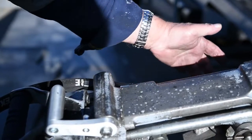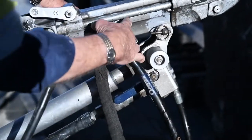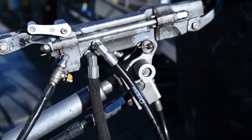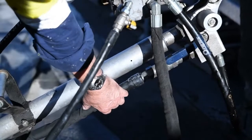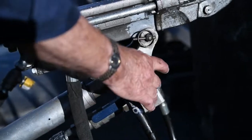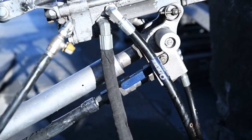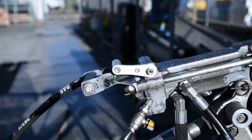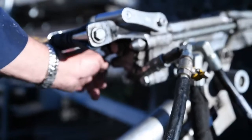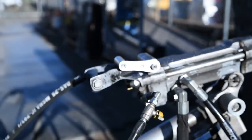Your inlet line tees on the valve of the leg, comes round and goes into the inlet side — it's got it written on the drill: 'in'. Then your outlet is the drill back to tank. You've got your third one which is the leg return to tank. And this is water for flushing. The knob at the front is the throttle for the leg, the blue handle is the dump for the leg, and this is the drill throttle. There's a little lever here — that's the rotation: forward, reverse, and neutral.